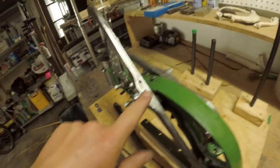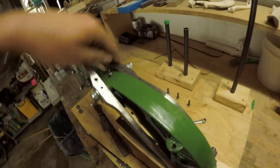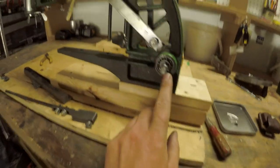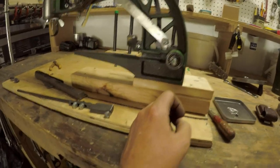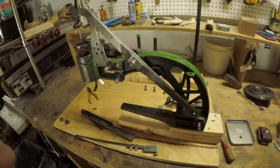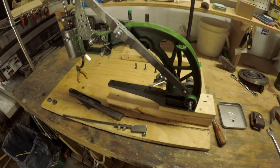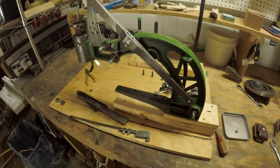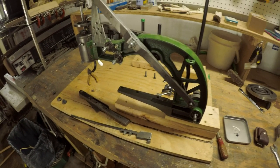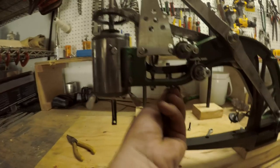You have an oil port here and an oil port here. They just really don't move a whole terrible lot. I'm going to put some axle grease in here and maybe file in here a little bit too. I think that's all the greasing I'm gonna do. I'll get it all put back together, clean it up a bit, and then I'll grab some leather and do some stitching, messing around with the stitch length which is adjusted right here with this screw.